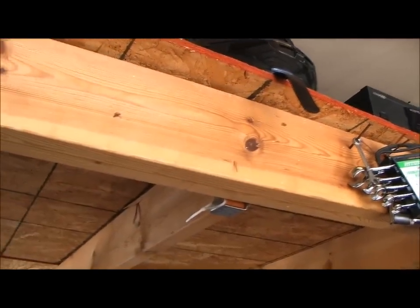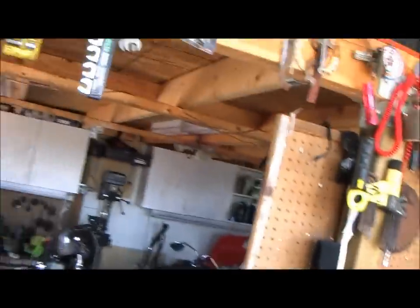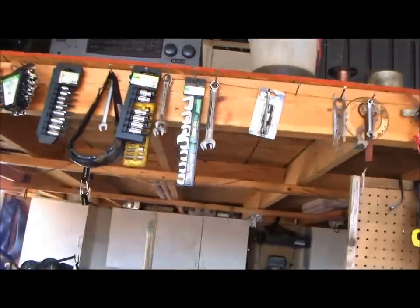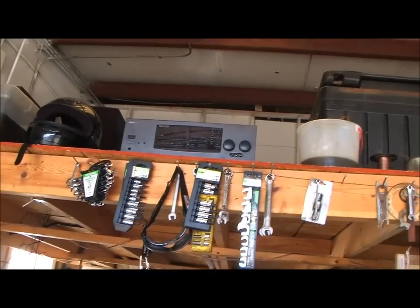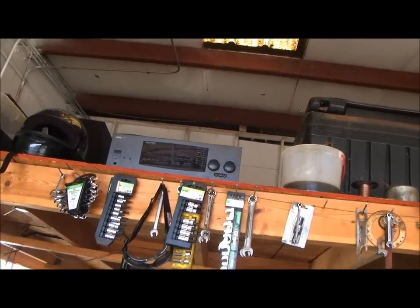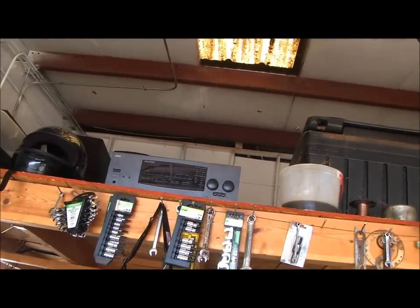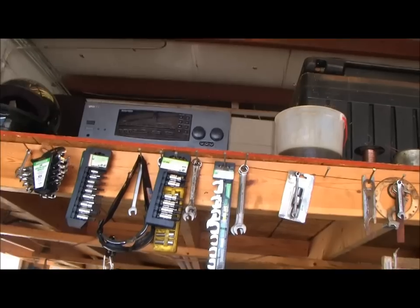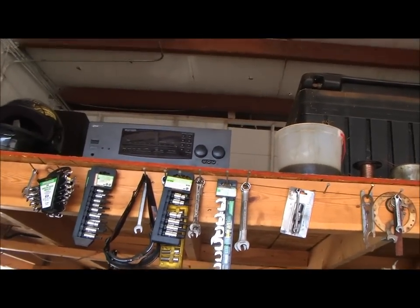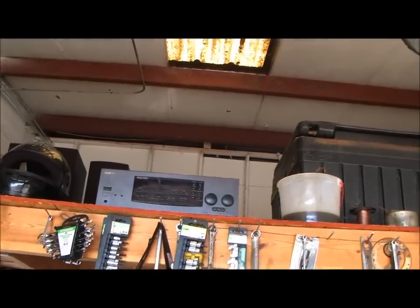On pushy amps like that Kenwood, it's not even going to protect itself. With that 4-ohm speaker on there, I could probably crank it all the way and kill it within a day. Kenwoods were never made very well — they're not like a Sansui. Sansui, you can drop them down to 4 ohms and they don't care. They won't tell you that in the book, but Sansui's tech sites show a lot of guys running them at 4 and 6 ohms.